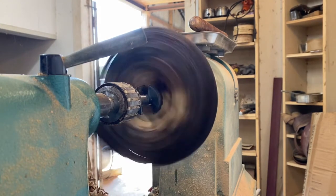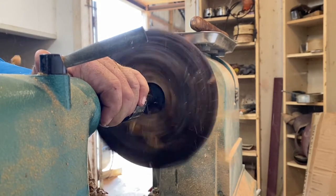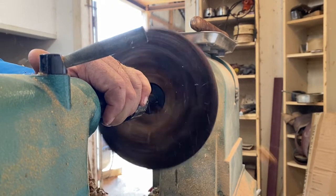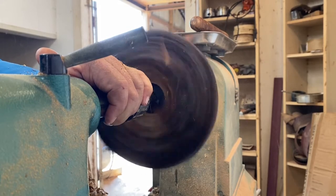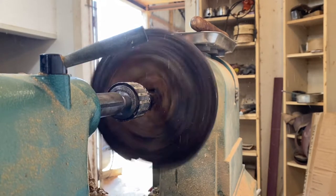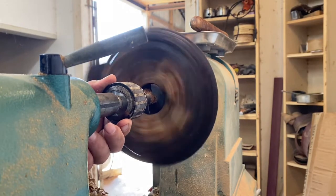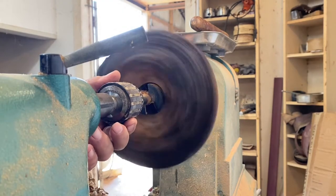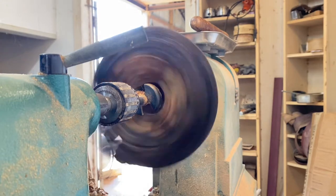Save a little turning. You don't wanna drill real fast. I usually go somewhere between 500 and 700 RPMs, according to the wood. This is real funky in the center. To get to the bottom. And you see people holding this chuck here, and I figured out a long time ago if you help hold it a little bit to keep from spinning, it doesn't get started spinning and ruin your chuck.